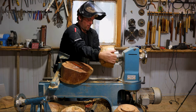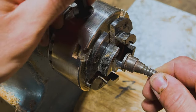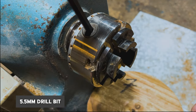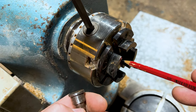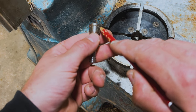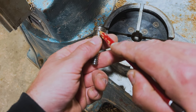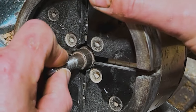The first thing I want to show you is the chuck screw. It looks like this, and this is a drill bit that I've taped to the depth of the screw that I use, and that brings the piece of timber nice and flat onto the front of the chuck. When I'm mounting the chuck screw into the chuck, my main goal is — if you see the back of the jaws just here — I want the shoulder of the wood screw just here. This flat section here is where the chuck jaws sit, and this sits behind the chuck jaws into that shoulder.